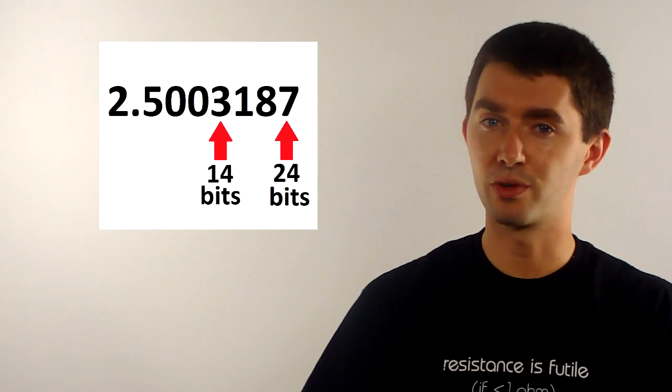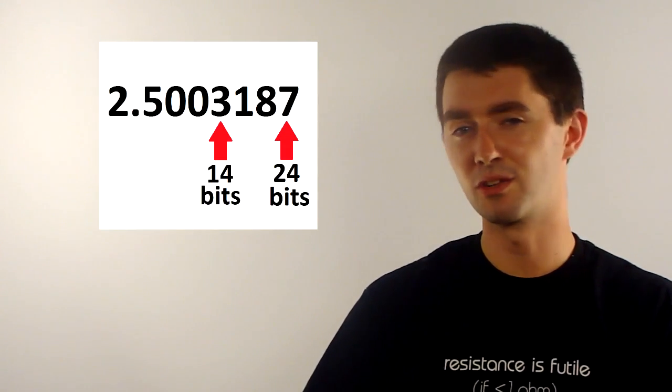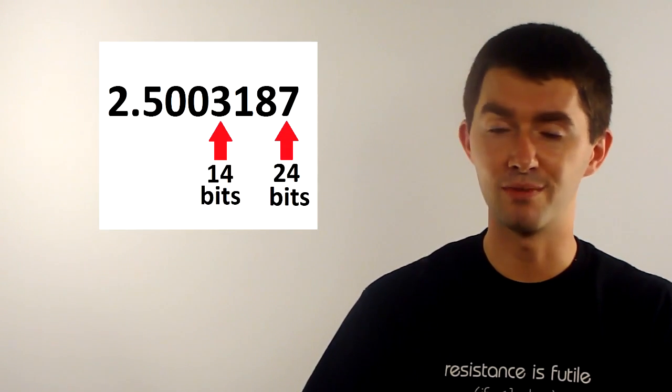At 64 kilosamples per second, you're not going to actually get all 24 bits. You'll probably get closer to 14, but you get 8 of them. And since it's a delta sigma, if you slow it down, you actually get more resolution. At $6 per 1,000 piece quantity, it really pulls down the price of an A to D in the 8-channel configuration. It's highly integrated, and it's really good if you're doing system-level integration.